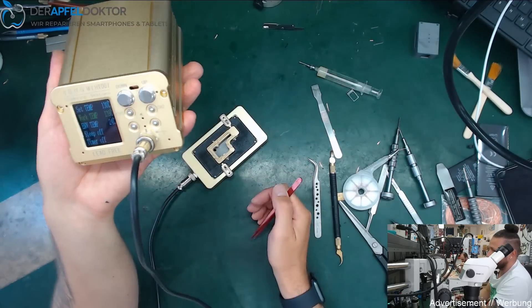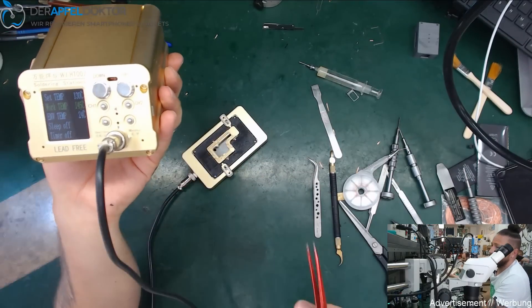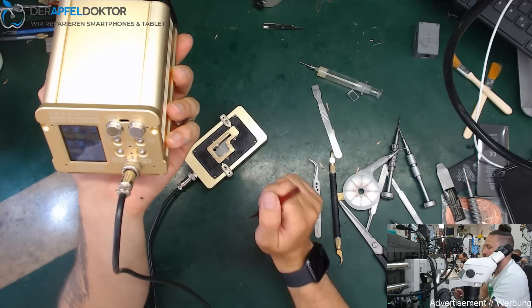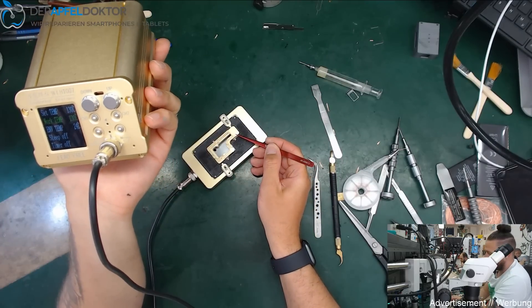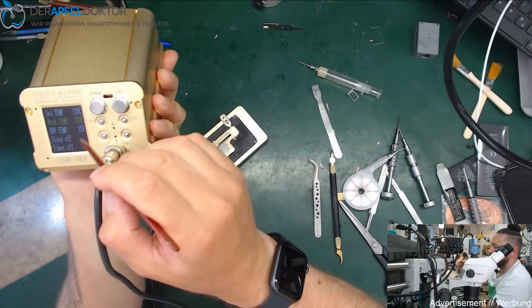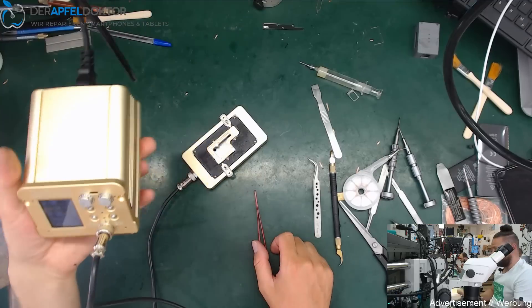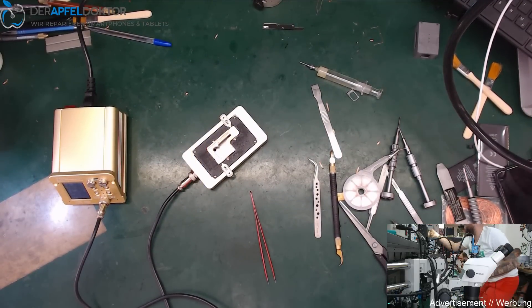On these Chinese products, the temperatures often don't match. I'm a fan of the PPD 120 because there I can calibrate on the potentiometer, but that option isn't on this station. No problem though — you can measure the temperature coming from the heating platform and then know how to set the main unit accordingly.